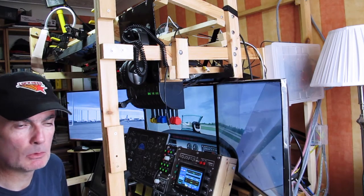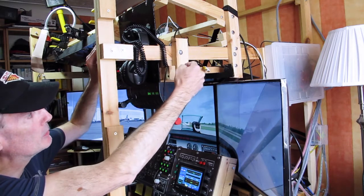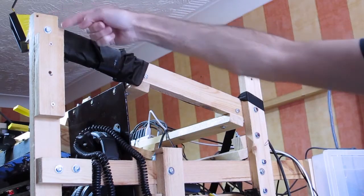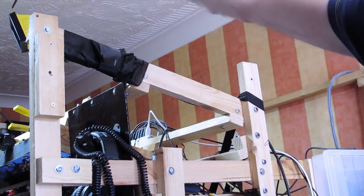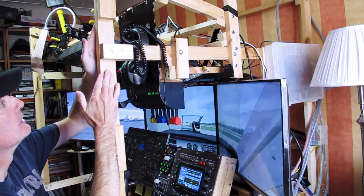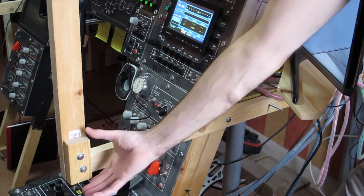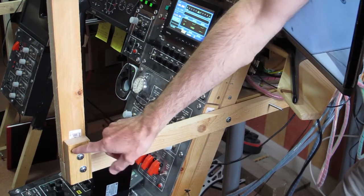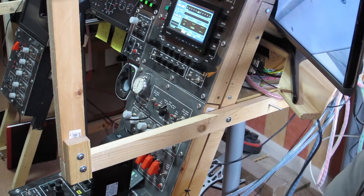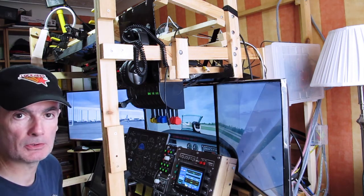I've simplified the description a little. In fact we're not going to undo this bolt. We will undo the rear bolt and the spar will move up — we'll just drill a new hole at the far end and re-bolt it. The problem is at this end: there's not enough height here, so this whole thing is going to be moving up. To compensate, we're going to detach it here and put a ten-centimetre insert of this kind of material in here to lengthen it, with some sort of external support to clamp it on. That gives us the extra height we need.